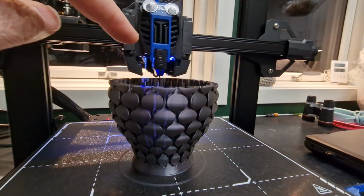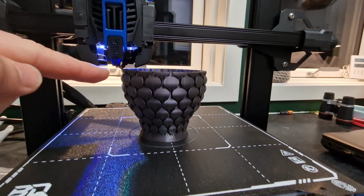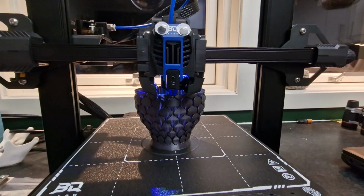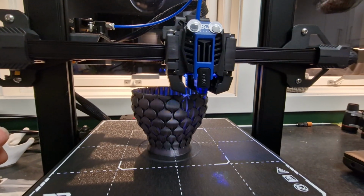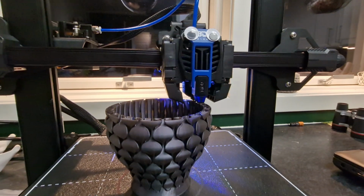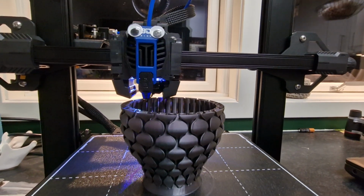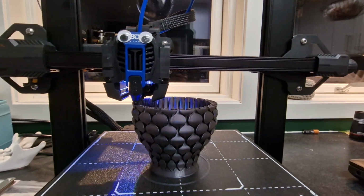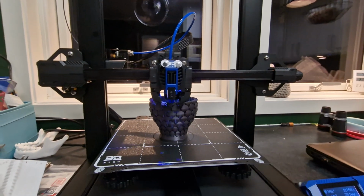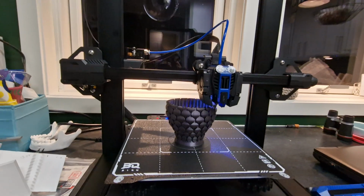So that was a nice feature, and it's really powerful. When it clicks out, it's solid. It's a clunk. It's got a metal tip in it, and it seems to be very accurate. So far, its accuracy has been down to like 0.003 or something like that, or 0.03. I can't remember, but very, very accurate and consistent. It did the 20 probes to test consistency, and there was very little variance between probing. So they're very precise so far. Been really pleased with that. Seems to do very well. Really not much more I could say about this.